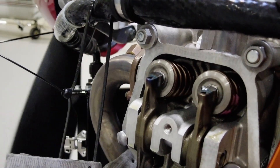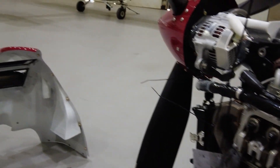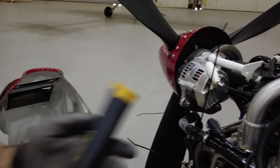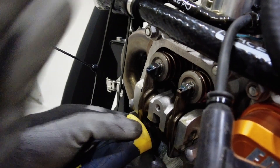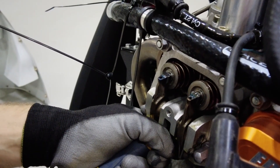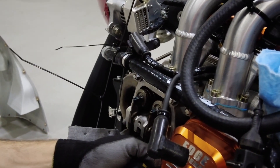Now here's compression. See where there's this space where I turn the prop and it's just a dead zone? Those push rods and lifters are at a neutral position, so now's a good time. There is a calibrated force — you're supposed to push on these to check, I think it's 10 pounds or something. But we just use our calibrated linear force applicator and lean onto it. What we're looking for — or I should say what we're not looking for — is a large air gap to open up. The more I lean on it, the more I'm actually going to compress the lifter and get it to open a little bit more, and that's normal. What we don't want to see is when I lean on this right away and a large gap opens up. We don't want to see any rattling when I lean on that. We want a nice smooth transition to that gap opening. These are good, and I'm leaning with some decent force — you can see I'm moving the plane as I lean on it.